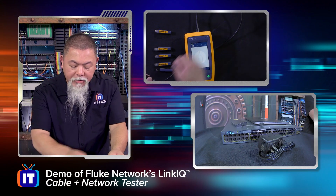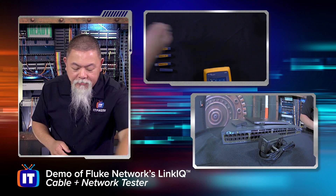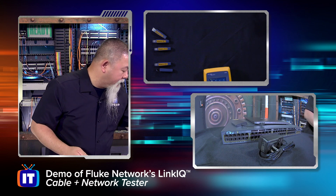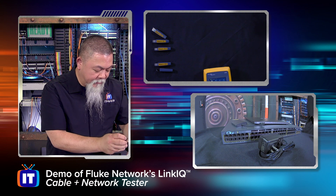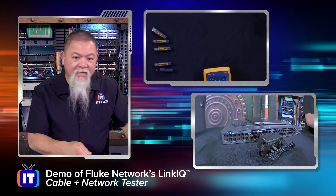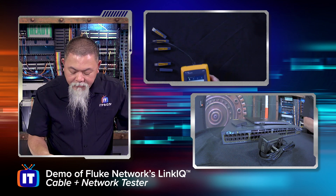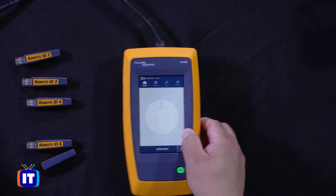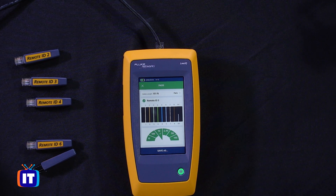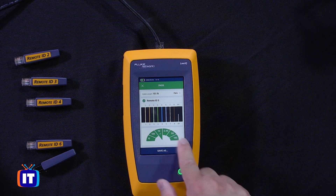Now I can change the entire cable out and do testing on another cable. We'll pick another cable and I'll even pick another remote ID, so you know I'm doing that. I'll go ahead and change it to a slightly longer cable, plug the adapter into one end, and the other end in as well. I hit auto-test, and now we can see I have a much longer cable in place — and this one actually did end up passing. At 1G, it gives me a nice little checkmark showing everything is good.